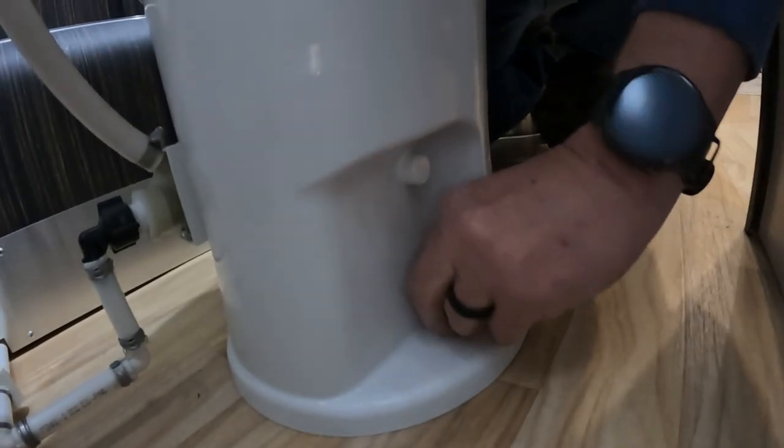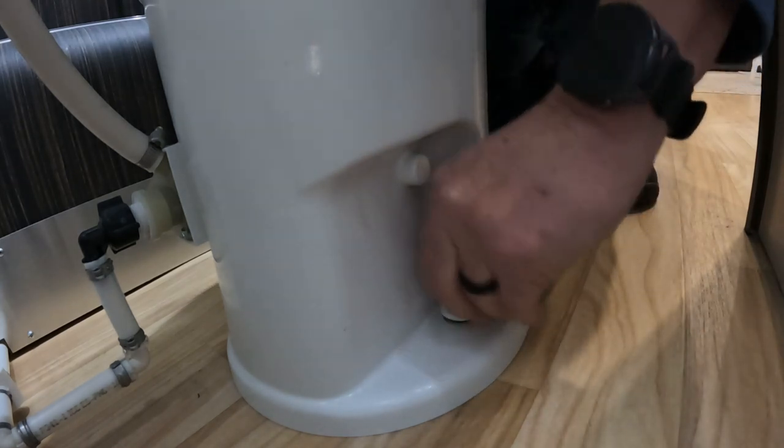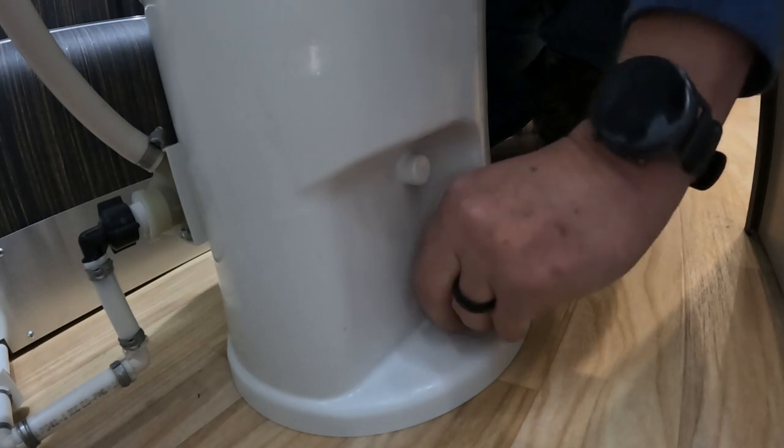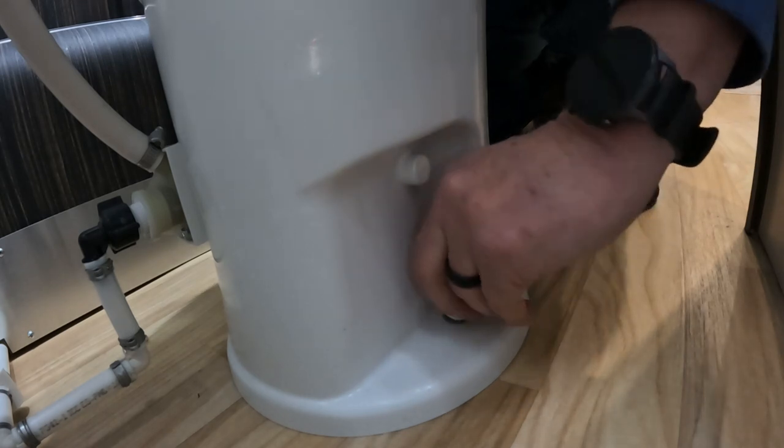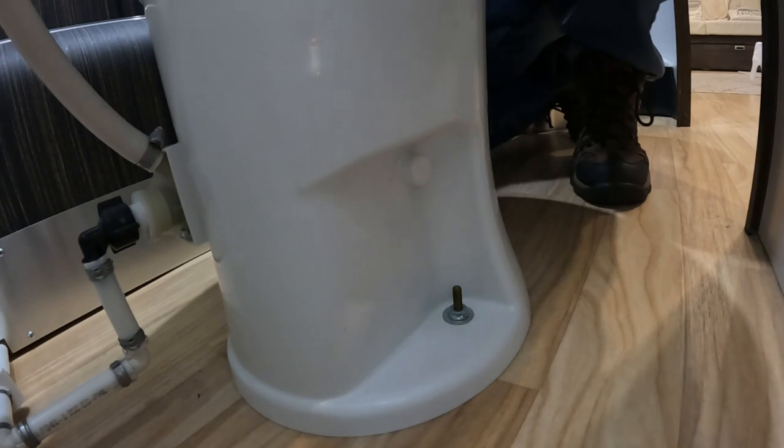Okay, hair is up so it doesn't get in the toilet. Everything in an Airstream is supposed to be standard, so we're going to use a 7/16ths. We'll use a screwdriver to pop the white covers off and then we'll see what we're up against. We'll get these bolts off before we unhook the water, just to make sure. Water is turned off in here. That part of our toolkit includes paper towels because there may be some leakage. The toilet has been flushed, water is off.